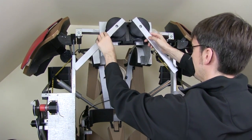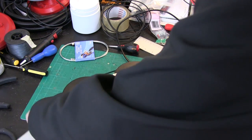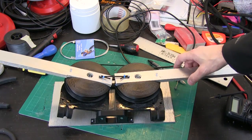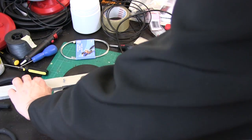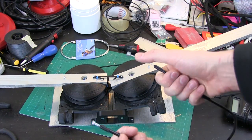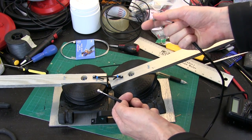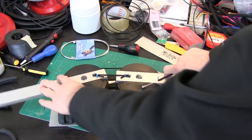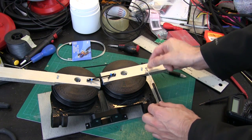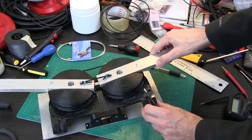So let's talk about how that's going to be sprung and activated. I've added some bungee cords — the black cord here is flexible and holds the two so they pull together, and I've also got one wrapped around the pulleys which pulls them upwards. These let the mechanism float to show how it will sit when the back panels are open, and then cables will pull around the pulleys to hold this down. I'm going to use bicycle brake cords — these are actually for the front brakes of a bicycle, a cable inside a tube, so when you pull one end it pulls the other. We need a double action: turning the pulley and controlling the pitch of the sticks, possibly independently. The plan is to attach this to the anchor point and have the inner cable pull the pulley round, while the outer cable is anchored so that pulling it controls the pitch of the two sticks.